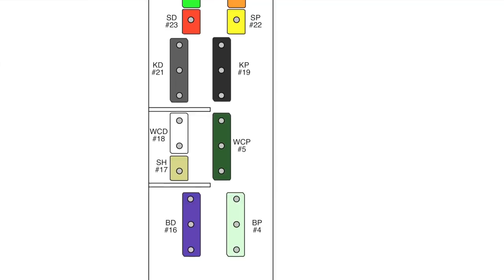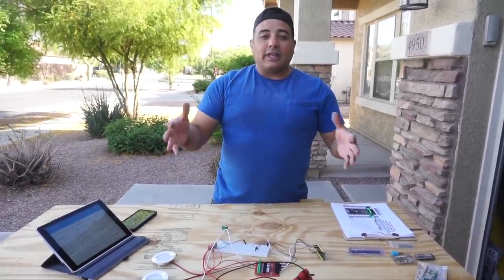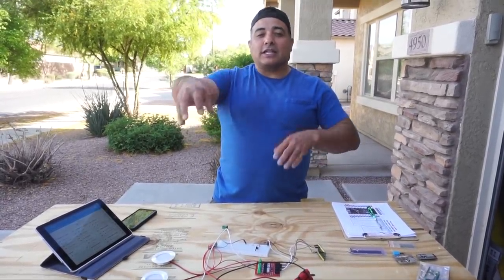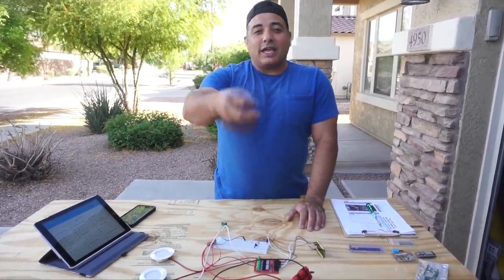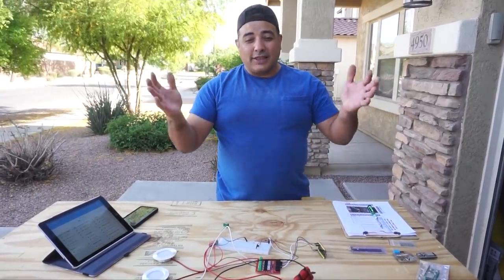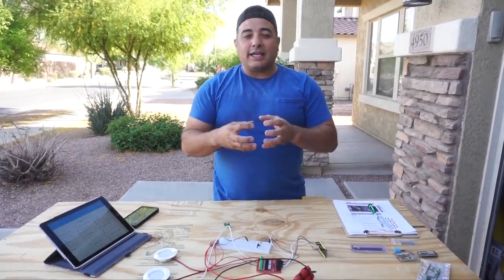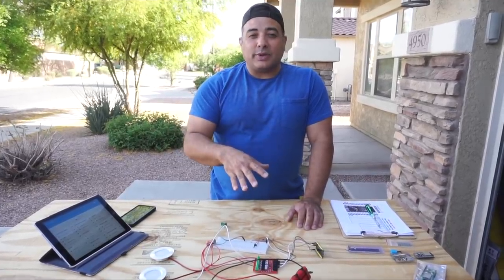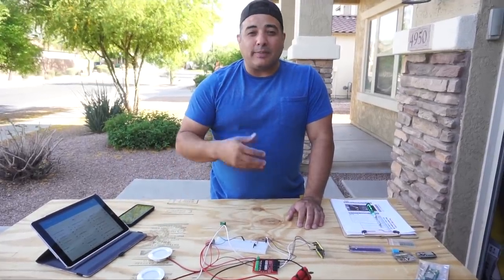In the living room area, we have 8 lights planned, and we have a left side and a right side, but the living room area is a little bit larger, so we also divide that in half. So there's 8 lights, but 4 sections. And the kitchen is very similar in that it's left and right only. So I think there's 6 lights in the kitchen, but it's 3 and 3. So we've tried to group the lights together in a way that made a lot of sense, both when using a switch and when controlling it via a piece of software or some automation piece.